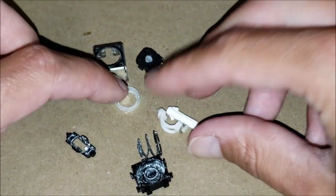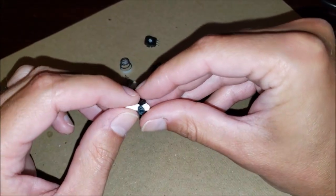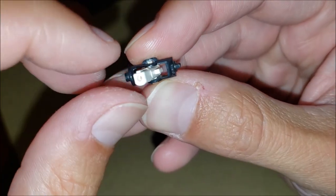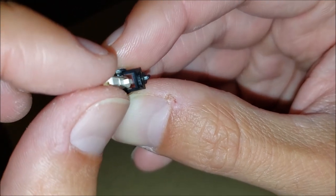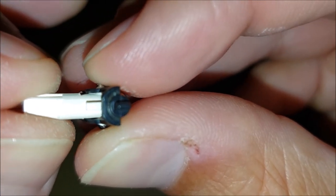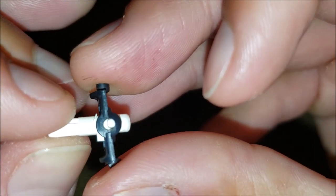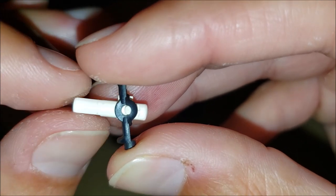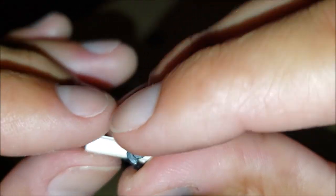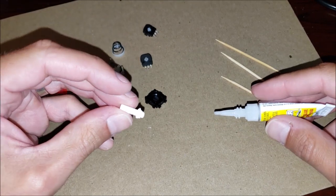I've cleaned everything up a bit, and I think I found the crux of the issue. It's the fact that this can wiggle in the pivot so much this way. This is the forward direction, and that is where we have our really bad wiggle. Just looking at it, it is going into that groove where the wear has occurred over time. So I think if I can fill in that space, I'll have less of a wiggle. Also, the pins holding onto it are a little messed up too. That could be an issue because it's falling down too much, making the wiggle worse. Whereas if the pin was nice and centered up here, that might also solve our problem. The first thing I want to try is just build up a layer of superglue to take up some of that missing space that was worn away on this stick.